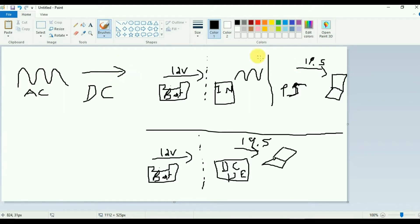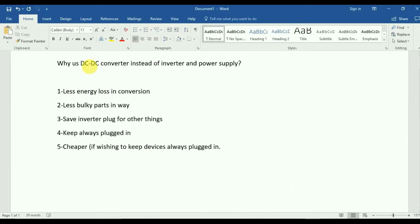The way I had it before: start with a 12-volt battery, and to get to 19 volts — since you can't just hook up 12 volts directly to a 19-volt device — it goes to the inverter, becomes AC, then through the power supply, and becomes DC again at a higher voltage. Each one of those conversion steps loses a little bit of energy. So with the old setup you lose energy in two steps, but with the DC-to-DC converter you only lose energy in one step.